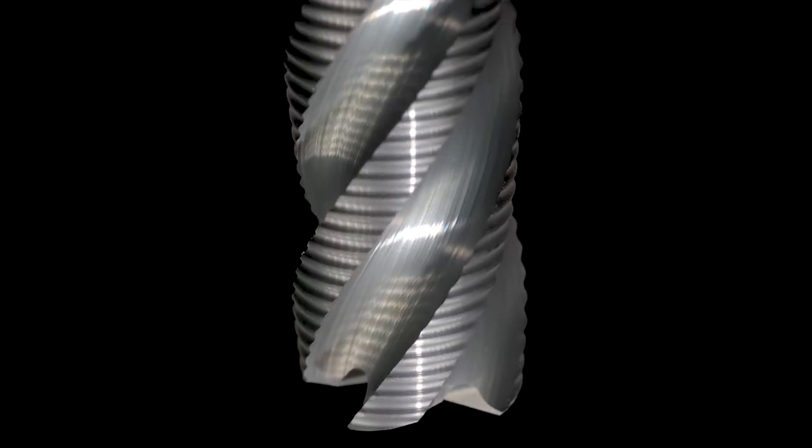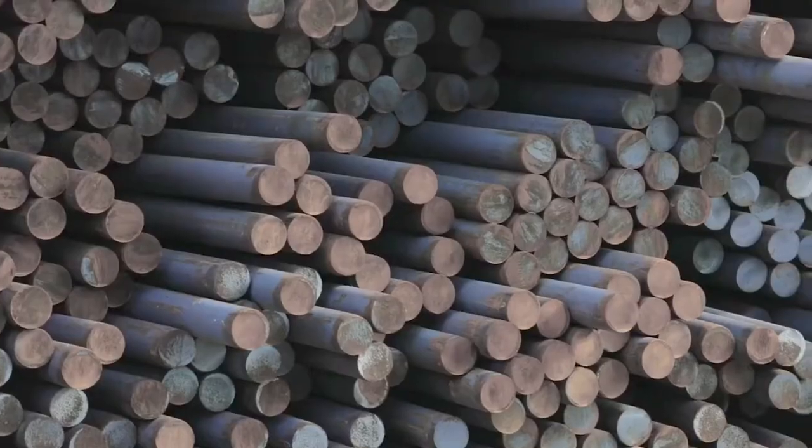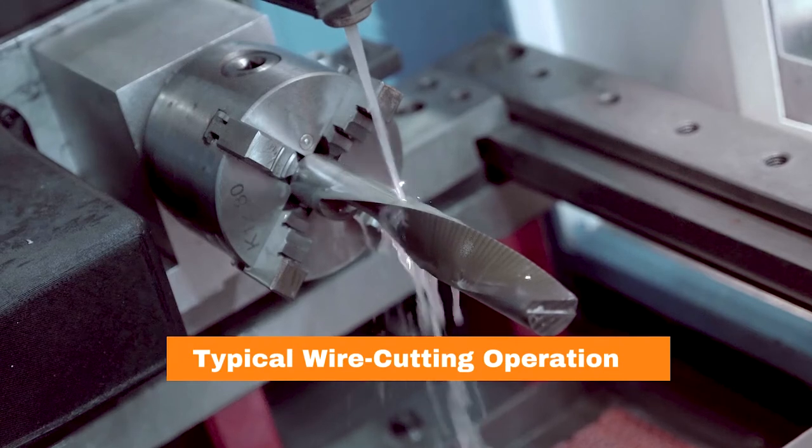In contrast, it is possible to have a good surface finish in materials like carbide even though their workpieces might be thicker, since their hardness allows them to resist the deformation. The fundamental reason why a wire cutting process is slower compared to other traditional metal cutting operations has to do with the nature of the wire cutting operation itself.